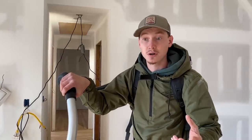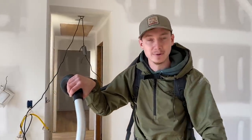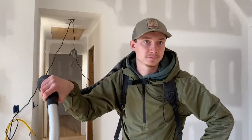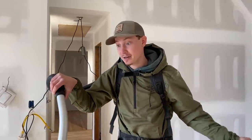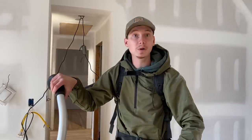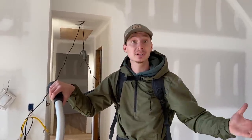It's a very strong type of finish, but I think it turns the hardwood yellow if you have white wood, like we have red oak. Exactly. That's what I was going to say. Over time, it'll turn it yellow, but that water-based stuff will keep it nice and pure, dude. And you can coat it 2 times for your very first coat. We're going to coat it 1 time, and then in about an hour or two it'll dry out, then we'll coat it again, and we should be good until we move in, dude.